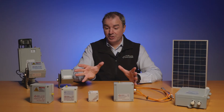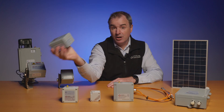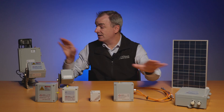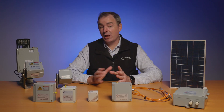So that's a wrap up of the solution in a nutshell — the interface node, the Omnitilt tri-axial node, the mini node for more indoor work, the Disto in 33 meter or 100 meter variants, the bracketry for setting this system up on site, the gateway, the camera, and the solar. For urban environments the 2.4 gigahertz radio works very well, but it also comes in a 900 megahertz radio variant which works better for longer ranges, making it the better choice for mining applications. For more information about the Wisen monitoring solution, please don't hesitate to contact us at any of our CR Kennedy offices. In the next video we're going to have a look at the software.